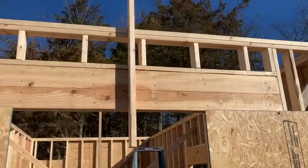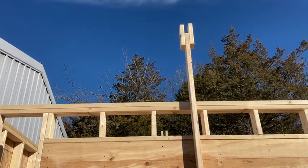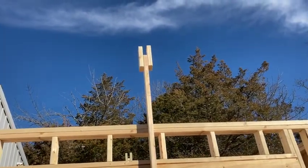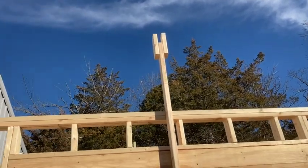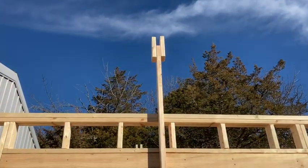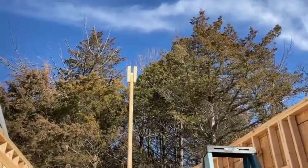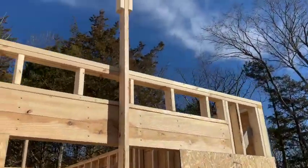Mathematically we know it's a 5 and 12 pitch. We know we're going 5 foot 7 and a quarter inches, and so mathematically I figured that I needed to be to the bottom of my ridge board from the top plate 25 and a half inches. That's all right because this is going to hold my ridge board really close and I can move it once I'm up there to line the rafters up. So I'm going to set the ridge board up there now that I have the first one laid out, and then we'll start putting in a couple of these rafters to lock it in place.